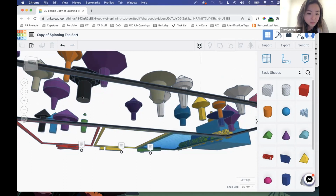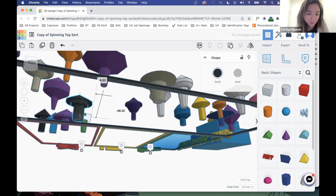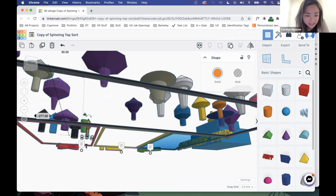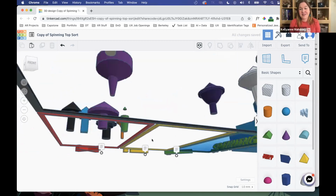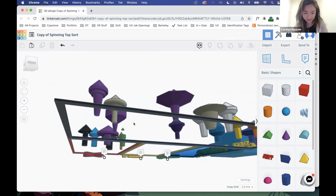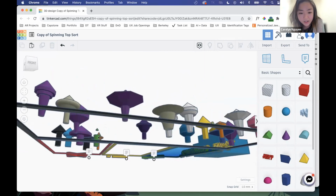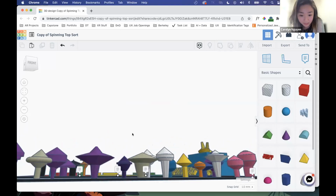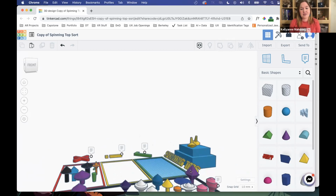And this one, with these corners and radii, is definitely going to need support material for sure. This one, the bottom layer is really thin compared to everything else. It's a nice tapering, though. It definitely needs an adhesion plate or a raft. And then on the other end, we're going to take a look at what would be easy to print. And we have a link to the answers as well.